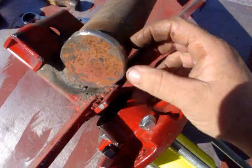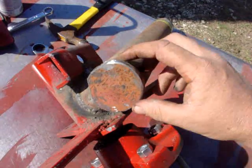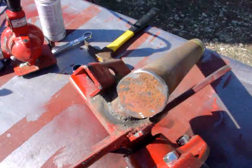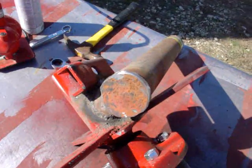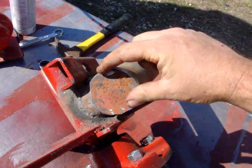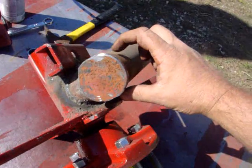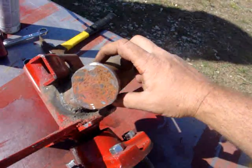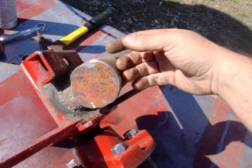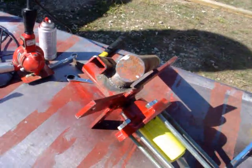This is almost a half inch thick — I just stuck it on there, had it out about this big, and just ground it off after I welded. This is where the top of the other pole comes up inside and hits the top up here. I should have a couple of washers — almost two-inch washers — and the other pipe from the tower will ride down on it. Those will be greased, and that'll be the bearing for the yaw bearing.